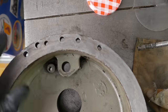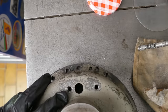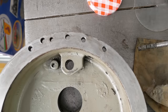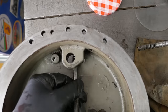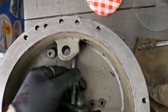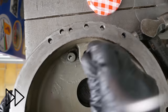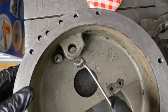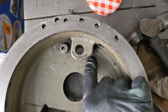It's peeking up out under here. Looks like half a helicoil. So someone's obviously helicoiled this hole at some stage, and they used a too long helicoil and did nothing to try and snap it off or cut it off. They're pretty brittle. I would assume you can just bash it with a cold chisel. Oh, it appears there's been two helicoils in there. Maybe I can cut that off with a cutoff wheel, little Dremel one.